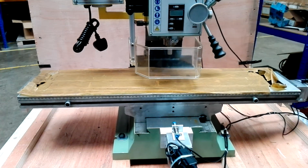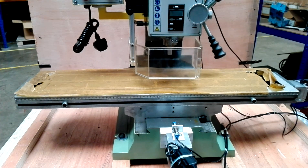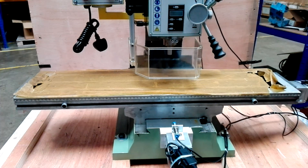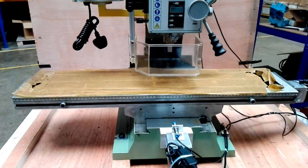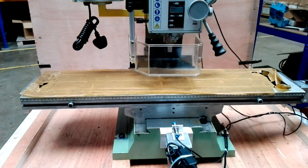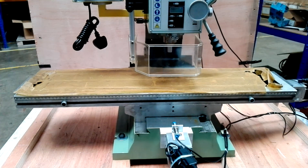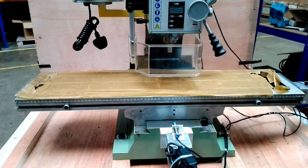It just gives you an idea of how fast the machine can run. Obviously, to be able to cut at these speeds, you'll really need to make sure that your spindle speed, your tool, and everything is capable of doing it. These routines we're doing now are basically what we would use on our normal mills, which use high speed spindles running at about 15,000 RPM.